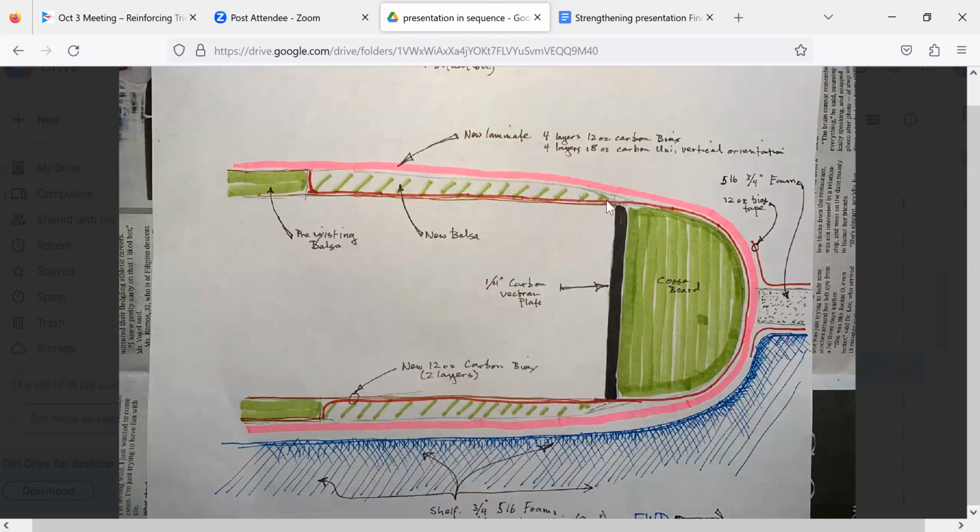So this is your centerboard case, the front or the back? The front. The front failed? Yes. So your centerboard pivoted when you hit something. Yep. And instead of tearing apart your boat or splitting your boat in two to the back, it hit the front and split the front into two? Yep, exactly. The aft layup did okay. The front layup was what failed. And if it goes backward, it has to go forward somewhere. Yeah, right. Then it rotates.